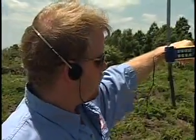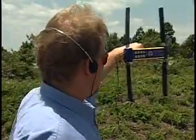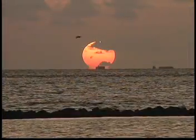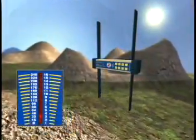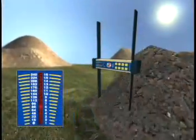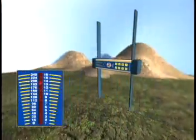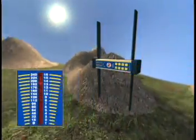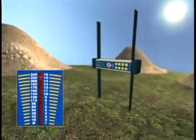You may be able to hear weak signals better when using the headphones. If you are getting a strong reading over a wide arc, switch to the zoom scale to find the center point of the signal strength. In searching open water or land areas, normally the only signal you will receive is that coming directly from the beacon. However, terrain features and large objects can create multiple signal paths from reflected signals. These will display as more than one signal peak while you are making a scanned circle.